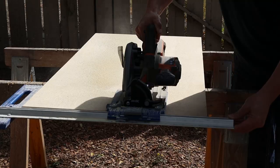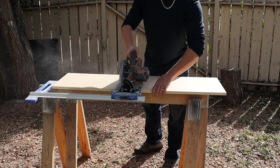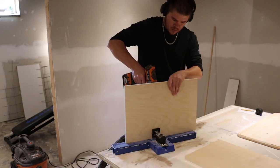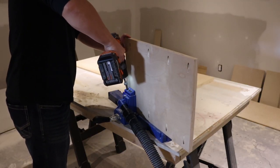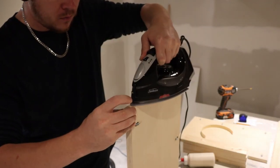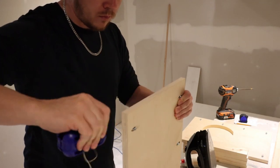The antique dresser and end table I'm basing this design off of are a simulated frame and panel, made out of pine — so that's exactly what I'm doing here. I've done this a lot on my channel so I'll gloss over it, but the basic construction is the same: pine two-by-twos for the legs, three-quarter inch birch plywood for the side panels, one-by-three pine for the side trim, edge band on the bottom side to hide the exposed plywood edge, and screw and glue everything together with pocket hole screws, then plug the pocket holes.